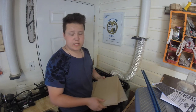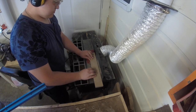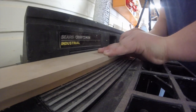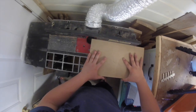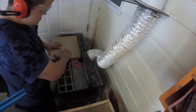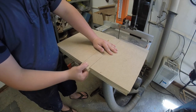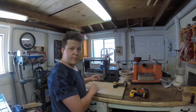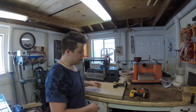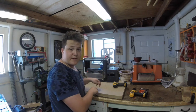Pieces C and D are going to fit on only one side each. This is going to create a sliding T-track so that we can adjust how big of a circle we want. You can see here how the sliding track works — I got a nice good fit and I actually have to go back and trim just a little bit because it was a little tight. I have my three pieces on the base all positioned for a nice fit, and I'm going to pre-drill and screw first, then unscrew, lay down some glue, and do a final screwing — because glue is a lubricant and it'll be easier to line everything up if I screw first.